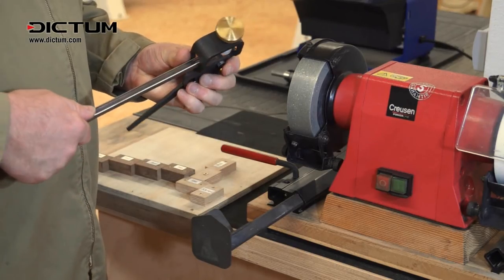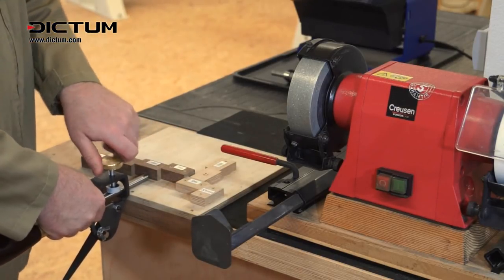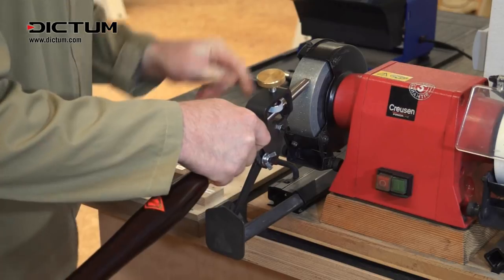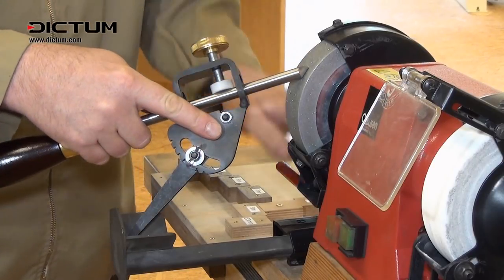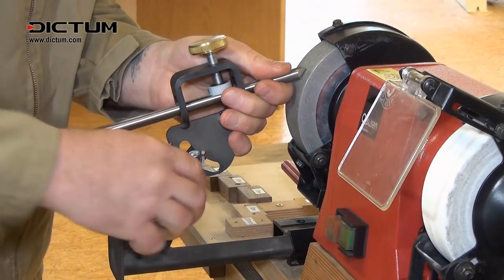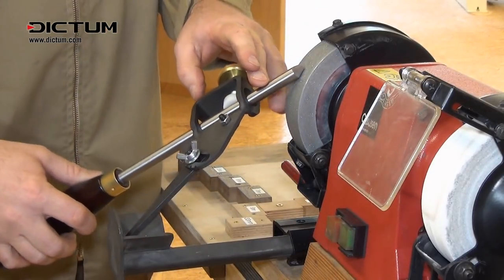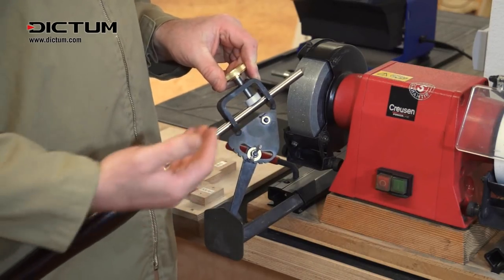Putting the two together, choosing somewhere in the middle, I'm going to go for a protrusion of 65 millimeters. I place it in the v-arm, move it until I have contact on the top edge, roll it over, and then adjust back just a little so it's touching on the side. With another small adjustment on the front leg I now have contact all the way around the tool and I can sharpen. This method will also suit many other grinds.